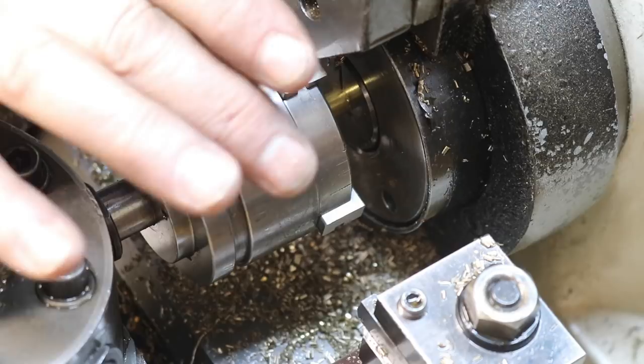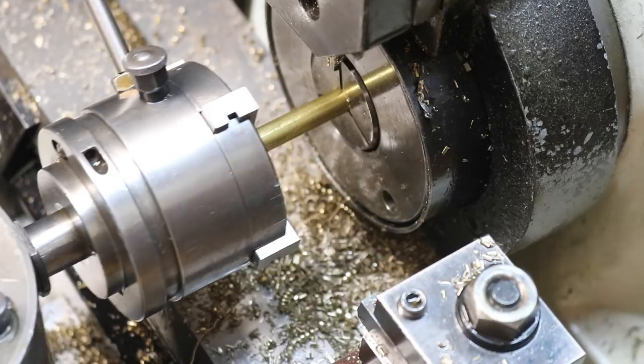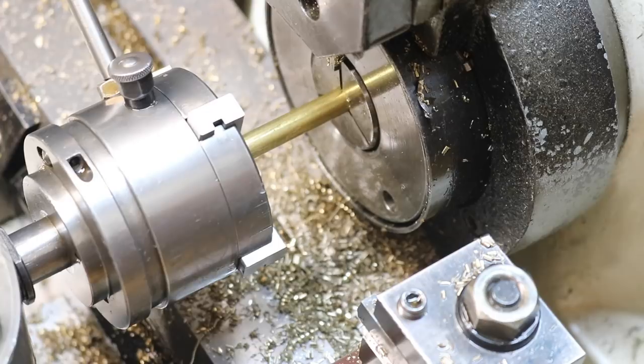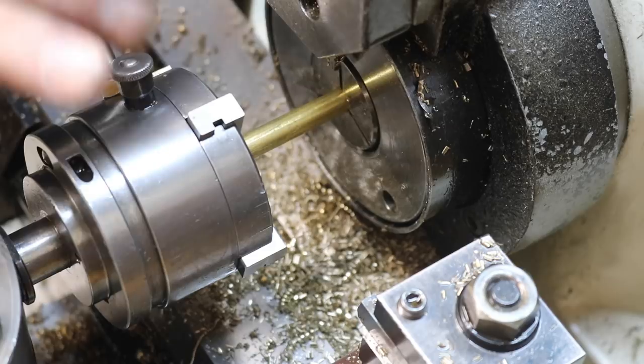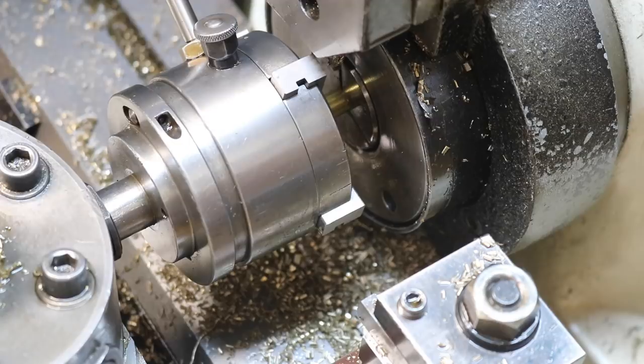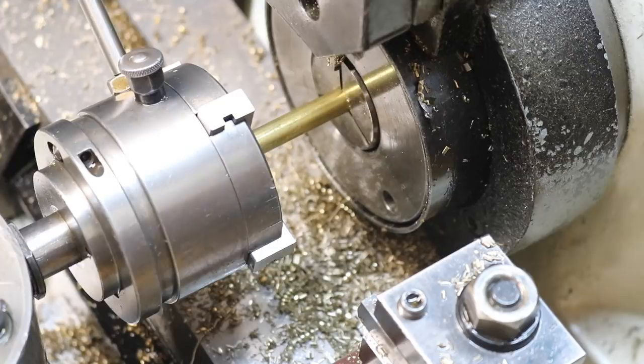Well, if you don't have a feel for helping this a little bit, helping relieve some of that pulling pressure, the head will pop open prematurely a lot of times. But what I'm getting at is when you do this, you end up getting a feel for it. And the more pressure you have to apply to keep the head closed so it doesn't prematurely open, is telling you your dies, your chasers, are getting dull. The more you have to help it, the duller they're getting.